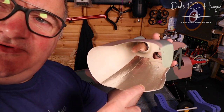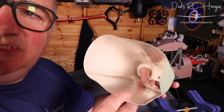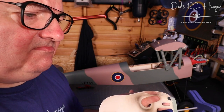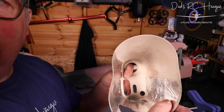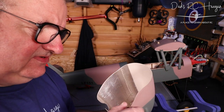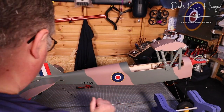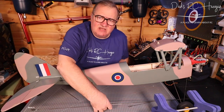You put some silver foil - this is plumber's foil, which is cheap as chips. Plumbers use this tape that they put around their pipes and stuff. You put it in and I just went a bit crazy with it - I've done it on this side, that side, and down there. It's really cool stuff. When you're peeling it off, always wait until you get to the end because it tends to stick to itself. It will reflect the heat and stop the cowling from buckling. Thanks John, top man!